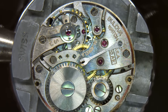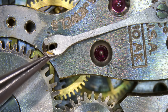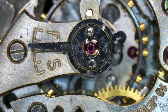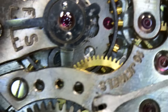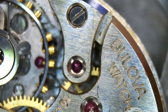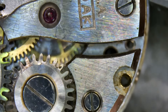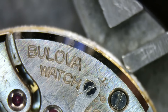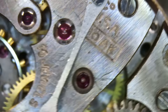With that wheel out of the way, I'm going to bring the microscope down and have a look at all the dirt and grime on this plate. Balance looks okay — pretty dirty everywhere. Nice timing screws all the way around the balance. It's got its own little separate bridge for the escape — usually when you're putting train wheel bridges on it's the escape that causes the grief, but this one has its own, which makes it a lot easier. And we can see: Bulova Watch Company USA, 10AK, 15 or 16 jewels.